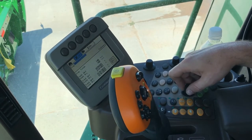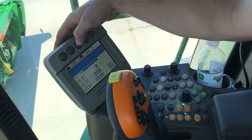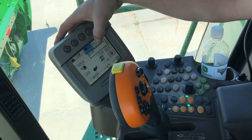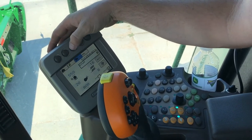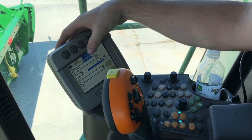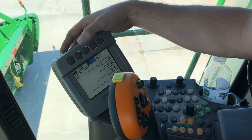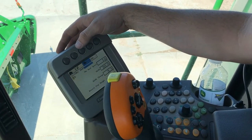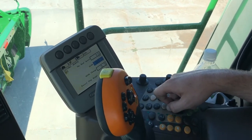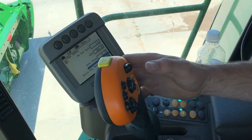Page four of four is where we would come in and change our crop from beans to corn, or corn to beans, or wheat, or whatever we're doing. The next button over is our combine. This shows our default combine settings for soybeans. If we hit that button again, this is going to pertain to our harvest track monitor up on the corner post. And this is going to show our flexible draper — this is where you could come in and change the width of your head if it's not correct. This is also where we would change our record stop height.